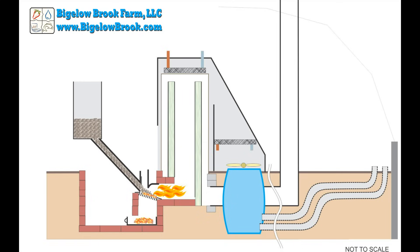Next, I installed two aluminum radiators. One sits directly on top of the barrel and the other above the blue barrel. These radiators are tied to the existing circulation pump for the aquaponics system and always have water flowing through them. I debated coiling some stainless tubing inside the barrel, but didn't for two reasons: the radiators were cheaper than the tubing, and I can easily see the radiators if they are leaking or need any maintenance.